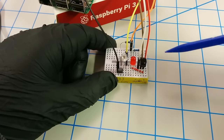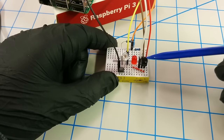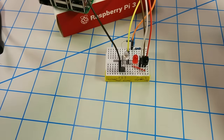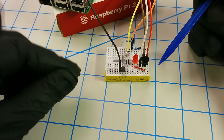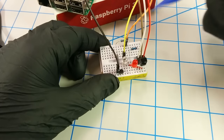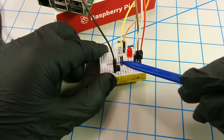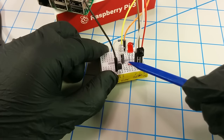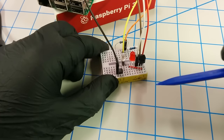The final pin — the collector — is hooked up to ground. The theory behind how this works: you take your infrared device like a TV remote, hit this infrared receiver, and it maps out the code. The LIRC open-source software package maps all the codes to the corresponding buttons, and once we have that configuration generated we can output those commands via this infrared LED. Just note the orientation of the LED — I believe this was cathode/anode, and this is anode/cathode — but honestly if you mix them up just flip them around until you can get it to work.